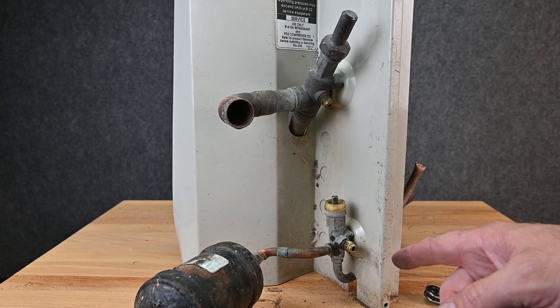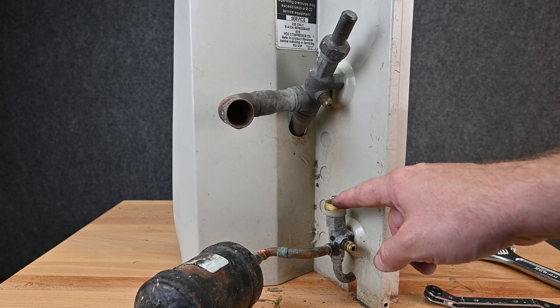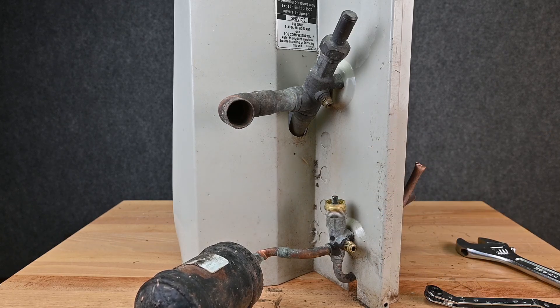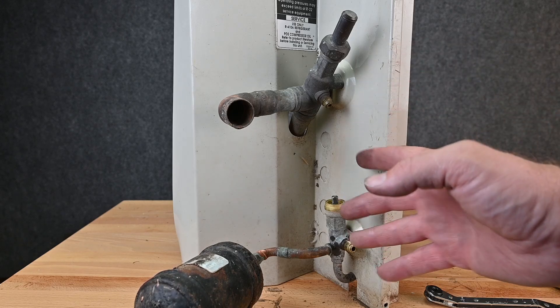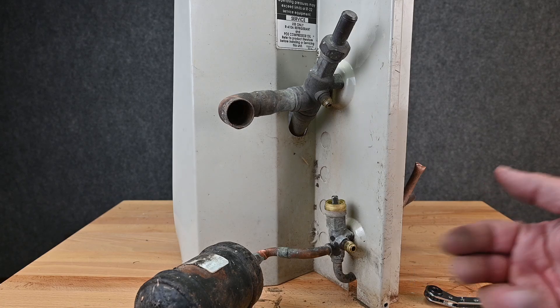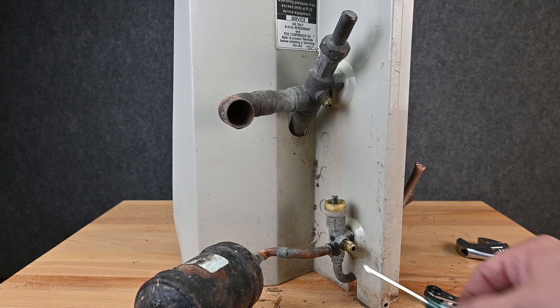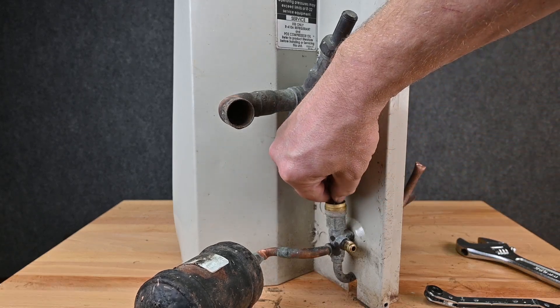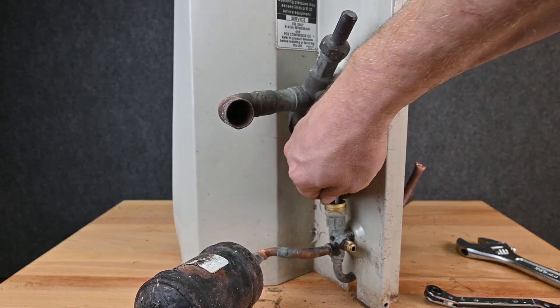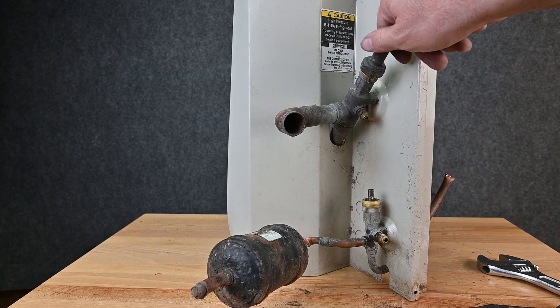One thing that's a little different about these valves is they don't have a packing nut — a lot of commercial refrigeration valves will have a packing nut to adjust, but these typically don't. You see these on some older Carrier systems and also some Lennox systems. I really like these valves because it means faster recovery and vacuum — nothing slows down the flow of refrigerant — but they're more dangerous for new techs because they have to remember to back the valve all the way up.